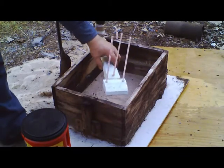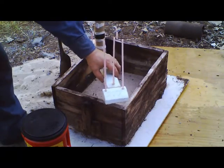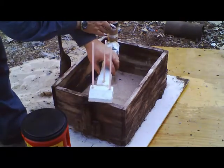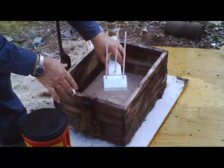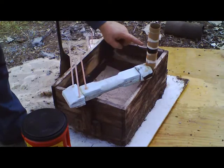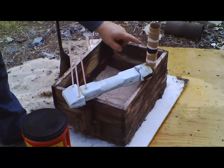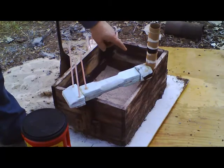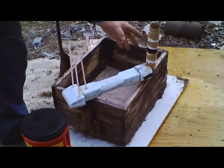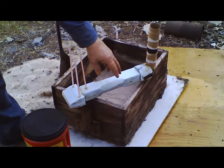Now I know you're looking at this and saying what the hell is it — it's a rammer. When you do green sand, this is what you use to pound the sand down around your pattern, and you'll need one. Here's another thing you've got to start stocking up on — paper towel tubes work good too. Toilet paper rolls — those are your sprues going into your casting.